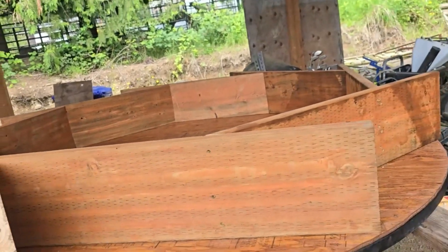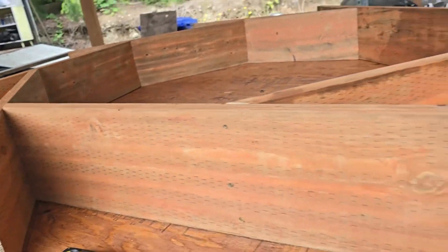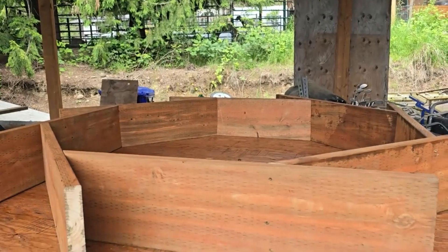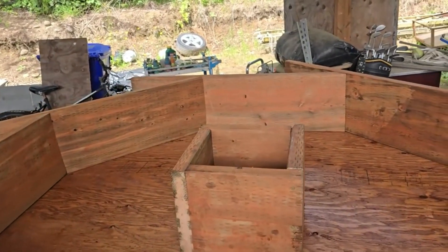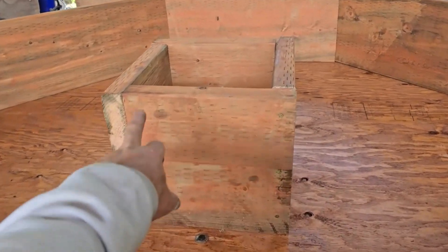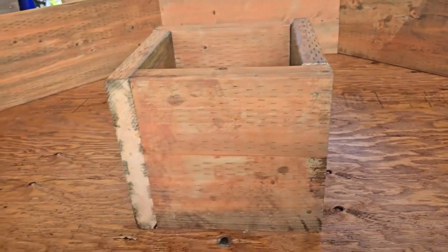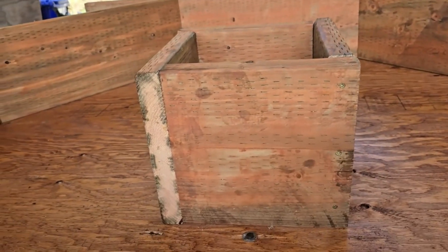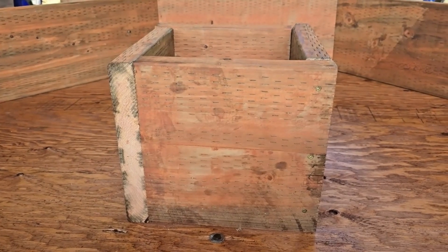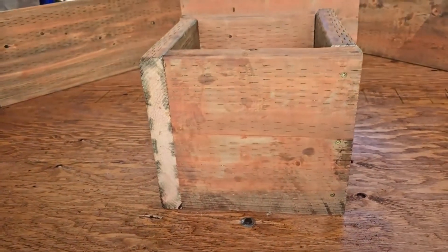The next one will go up on top. I'm going to make a box for that using the leftover pieces — I cut the fins at 43 inches, which left me eight-to-nine-inch pieces. We've got our center box for the spindle. The spindle's not going to ride on it; it's basically support for the middle of the wheel. The remainder of the two-by-twelves cut at 43 inches left us a perfect 13-inch square, which is big enough to get around that inner metal welded circle and still screw up through the plywood.